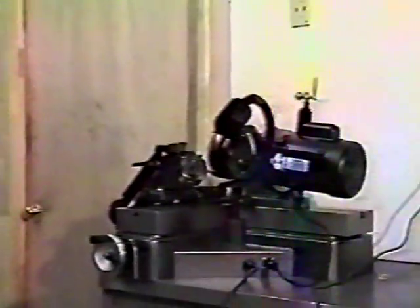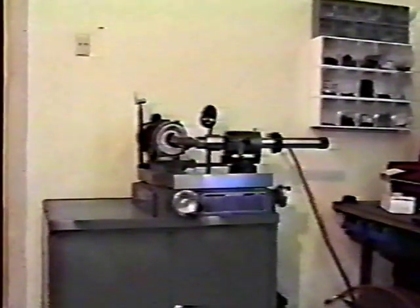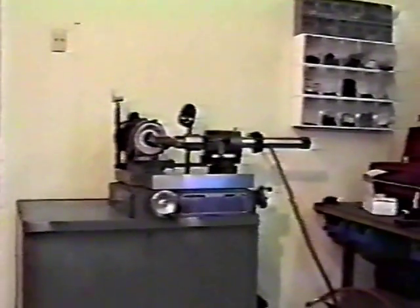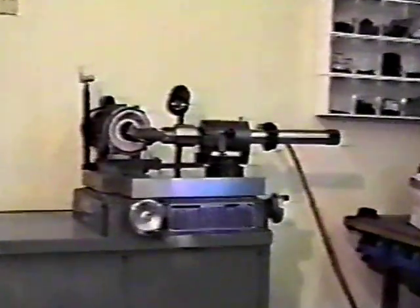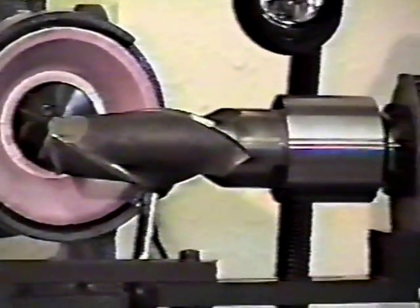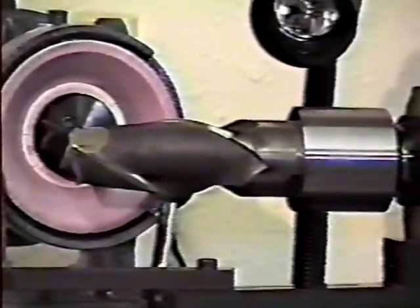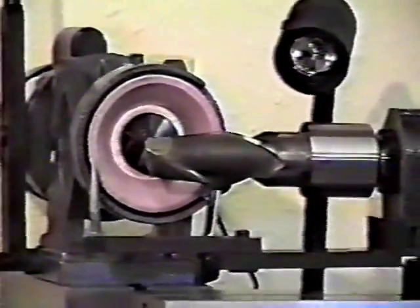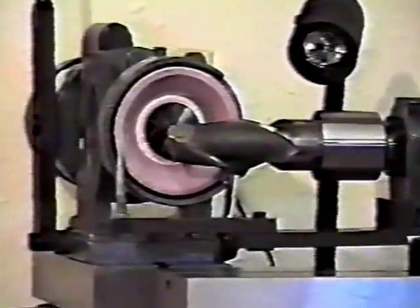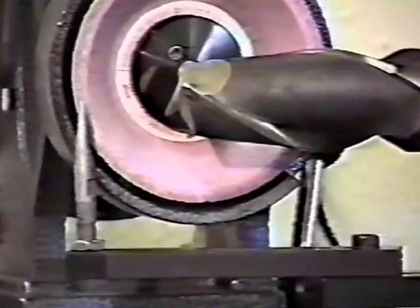To sharpen end mills, we will go over some additional features of the machine for other applications. To sharpen end mills with larger shanks, special 5C end mill holders are available for tools with shanks of 1-1/4 inch, 32 millimeter, 1-1/2 inch, 40 millimeter, 2 inch, and 50 millimeter. For tools with long flute lengths, an optional stylus bracket extension is available. The stylus is set in front of the left side of the wheel instead of the right side.